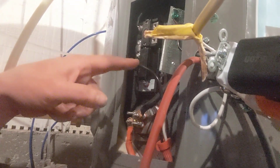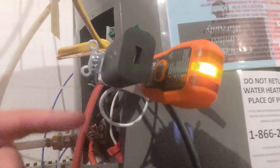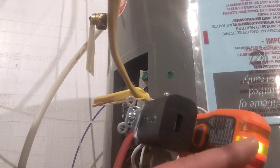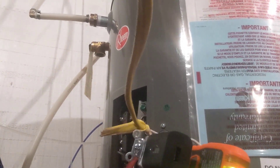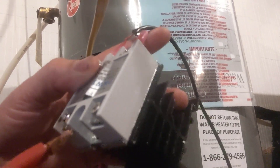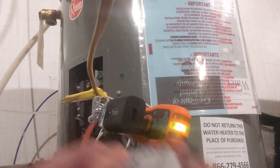This is not safe — this is a temporary proof of concept. Basically you can see I've got a plug here, and my light is on because I've got an open ground right now which will be fixed. The thermostat, when the temperature is low enough, supplies power to this plug. This plug has a USB charger that then goes to this relay — three or five volts in — and it connects the DC power. So when the thermostat closes, AC power triggers this relay, which then opens up the 48 volts to go to the heating element.